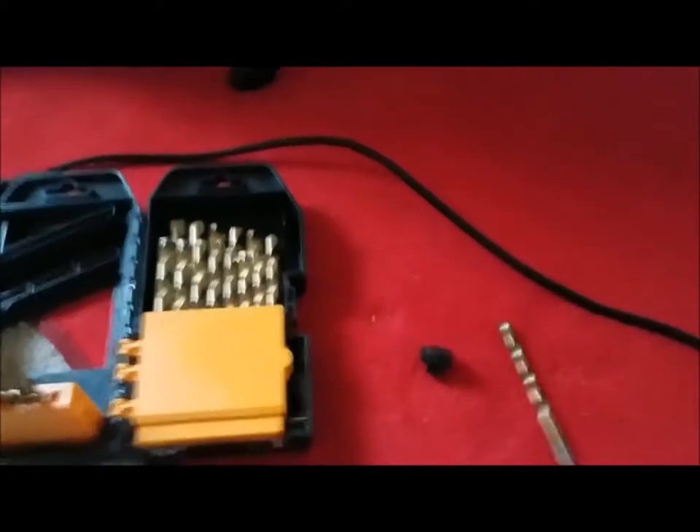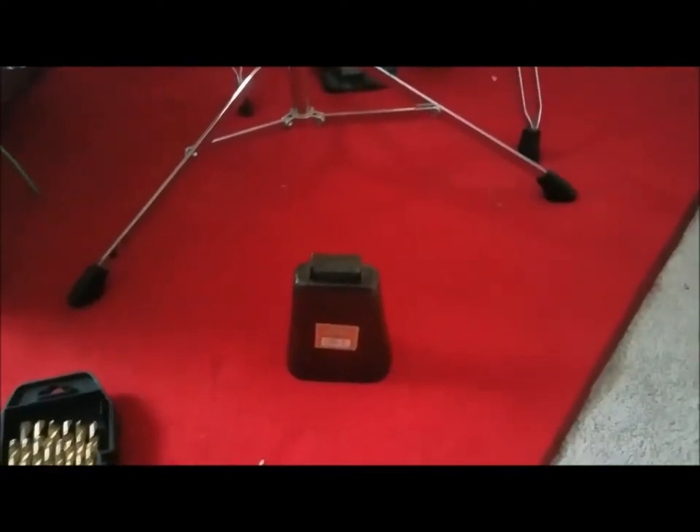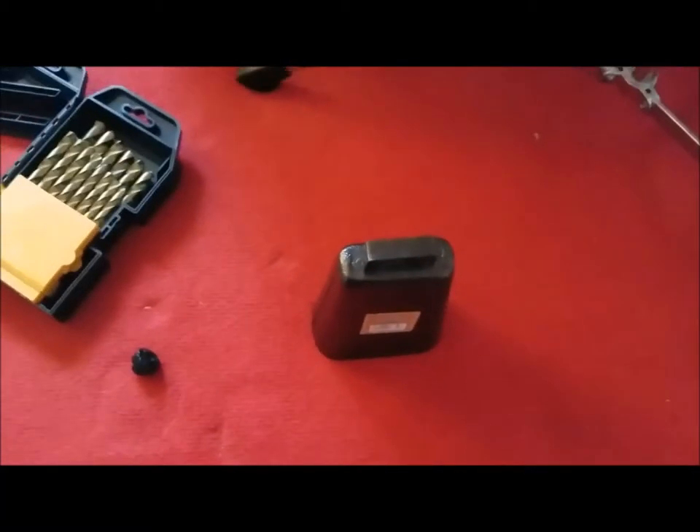Your hole width. So you're going to get your cowbell — it's got a lip around the top — and I'm going to drill right through the center of that thing. It might be nice to have a measuring tape, but I'm just going to freehand it because I have eyeballs and I think I'm pretty good with them. One thing that will help you do this easier is light. The other thing that's going to help is if you mark the center, take a pilot hole, and go through that — it might make it a little bit easier, depending on how good your drill bits are.